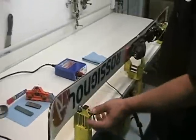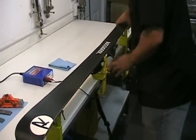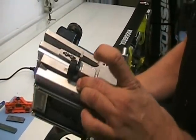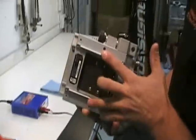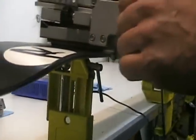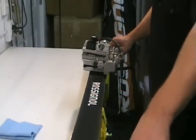Once you've done that, you're ready to start using the slow glide machine. Put the skis in the vise as if you were waxing, so base up. Once you have that locked in, do a quick dry run with your machine — you have it set up in the side edge mode. Select the two sliders directly on the base of the ski; there are two bearings that will butt up against the edge. Push the lower tray gently against the edge, then do a quick dry run to make sure your cable and machine don't hit any of your vises along the way.